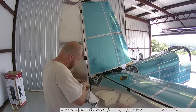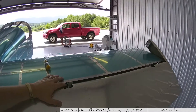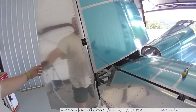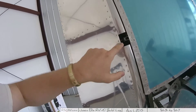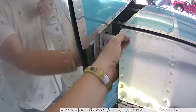I had a minor victory: when I hung the elevators there was binding, and I fixed that with a lot of judicious effort adjusting hinges and bolts. On the rudder there's the same potential issue at the top, middle, and bottom hinges. I have no binding at the top at all, which is awesome — perfectly smooth travel. The middle one I just need to screw out one turn to get the whole thing to line up perfectly. Lucky, because this could have been really difficult.